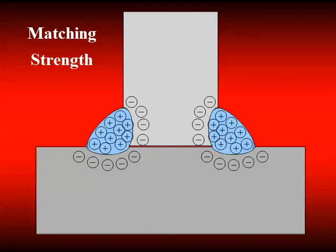This pictorial represents matching strength. The blue is the liquid weld metal that's solidified — it always is in residual tension when we deposit that weld metal. Surrounding the area of residual tension is the area of residual compression. Basic statics says we have to have both, and the net capacity of the section is not changed with these residual stresses. These residual stresses are estimated to be at the yield point of the material. Higher strength steel means higher residual stresses. Those residual stresses drive cracking, drive distortion, and impair our fatigue performance in welded connections.